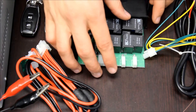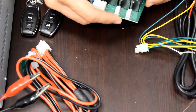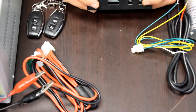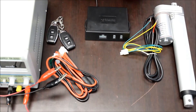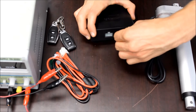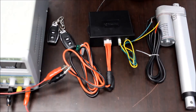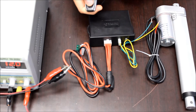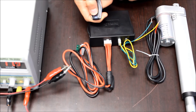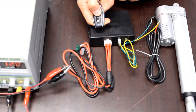To put the box back together, make sure the circuit board lines up with the top two grooves inside the box, and then it will slide back together. Then you can put the front cover back on and click it into place. Once the box has been resealed, reconnect the wiring harnesses to the front. Turn your power supply back on and you'll be in the other control mode. Now we're in momentary control — push the button and it moves, and as soon as you let go of the button, it stops. This happens in both directions.